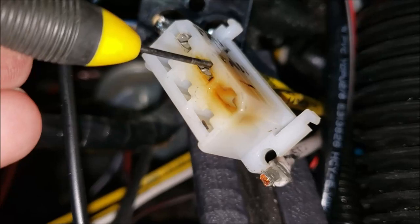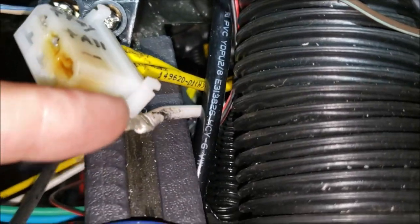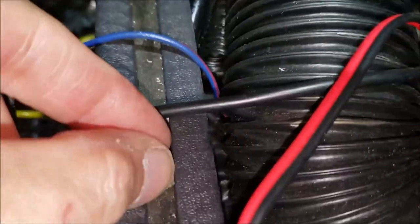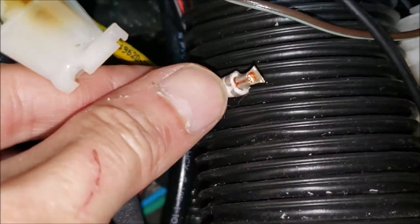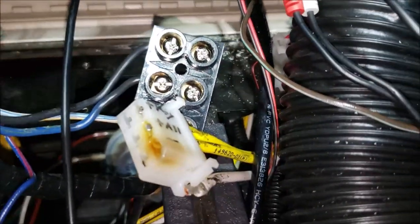I just took my screwdriver, put it inside that little notch right there, gave it a twist, and that released the connector. I've already cut the spade end off right there, so it's just this piece — it already has a good factory crimp. I'll put that in my new termination block and screw down on it good and tight. I've just got three more wires to go, then I'll put the fuses back in and give it a test run.